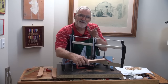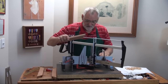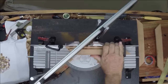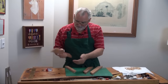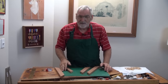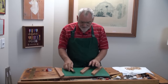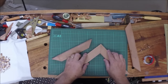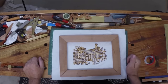So it's always a good idea, as I did with this one — I went two to four inches oversized. Better to have a little bit of wastage than a lot of wastage because you've cut it wrong. Now this would be the time, if you had a shooting board — which again I said I'd make — to clean up all the ends to make sure they match and they're all nice and square. These are pretty, pretty good, I've got to tell you. So just as a test — yeah, I think that's starting to look alright.